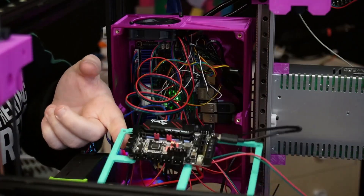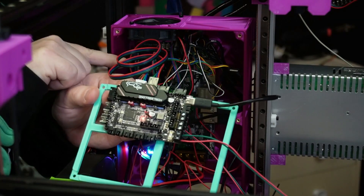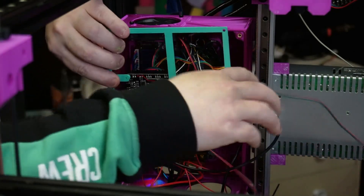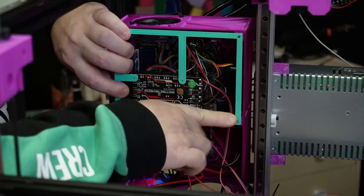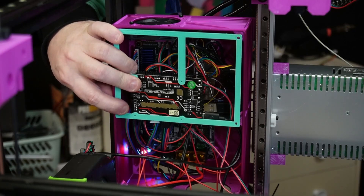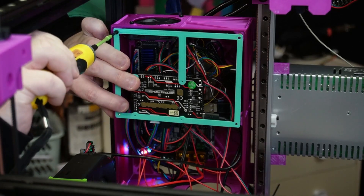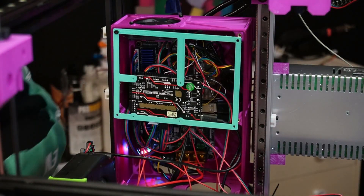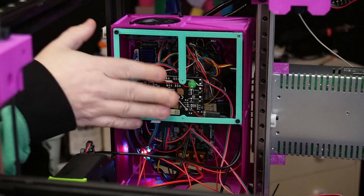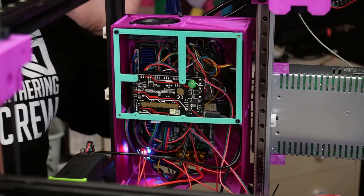The Pico is connected via USB to the MKS Skipper for power, with the X and Y motors wired in. My thought was it would sandwich inside when I put the lid on, but for now I'm just putting in a couple of screws temporarily. I may have to flip some motor wires, but let's get it in and see if everything works.